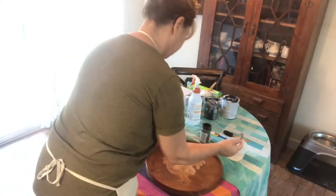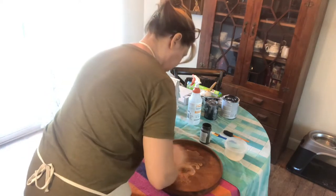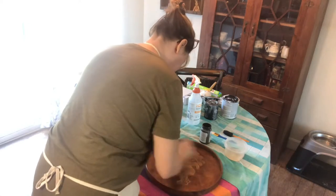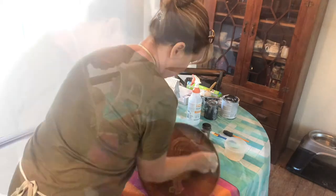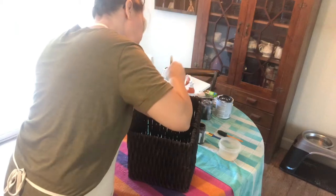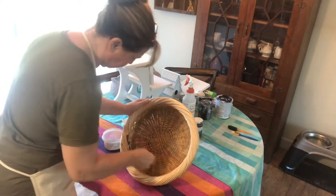This little wooden rooster tray had been worn down to the bare wood. I really liked the look of this tray and just kind of wanted to restore it. So I grabbed my Waverly Antiquing Wax and full strength just went right back over that bare wood to kind of match up the finish, and then I wiped that back with a paper towel. A little hanging basket that I had also had some knicks that needed to be touched up — did the same thing, just wiped on some Antiquing Wax and then wiped that back. Then I cut the Antiquing Wax with a little water to dilute it so that it wasn't quite so dark — I wanted to richen up this basket but not make it too terribly dark.